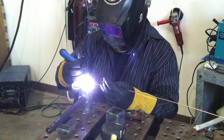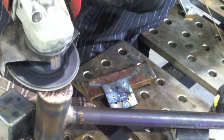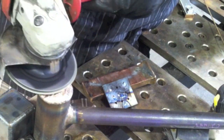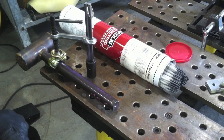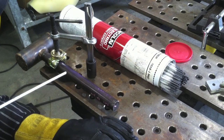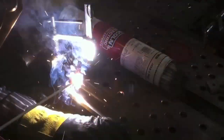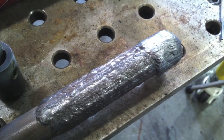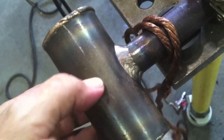There's the second layer. I got a grinder, put a little wax on the sanding wheel so it wouldn't load up, and sanded all those ripples out to a nice smooth surface. Now it's time to build up the handle. I made a little setup here with a strong hand tool — I can pretty much clamp, turn, or rotate anything. You can also lay it in a piece of angle iron as a little trough. I'm just going to run bead after bead stacking them halfway over each other. When I'm done I put a little extra on the end. If I had plenty of time I'd put another layer, but I'm out of time and got to go make some money.